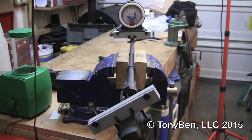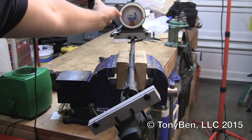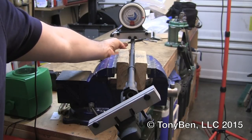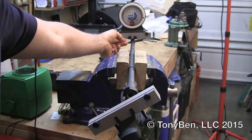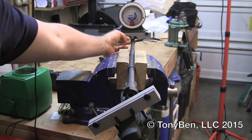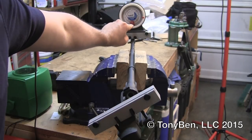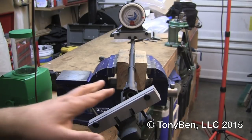Okay, so what you see here is the action set up, hand timed, in a vise. What I've done is zeroed out: I put this angle finder on top of this barrel timing gauge that replaces the front sight. It clamps onto the front sight and uses your front sight as a degree reference. In a perfect world, the front sight base on the flash suppressor should be machined perfectly. So we clamp it on there, throw the angle finder on, and rotate it in the vise until it's 0 degrees. Then you have a jig